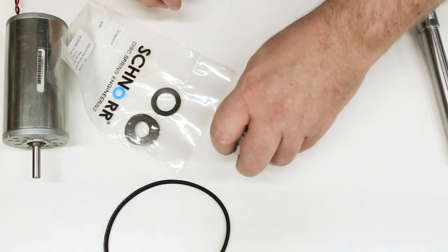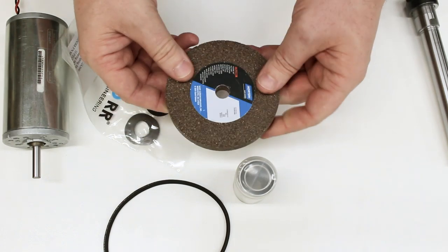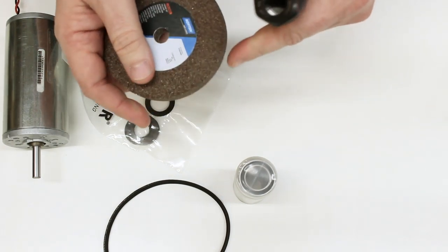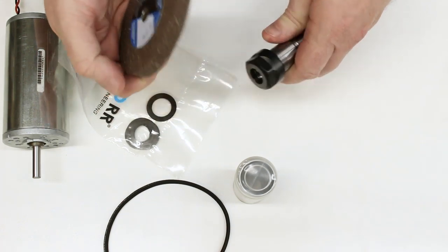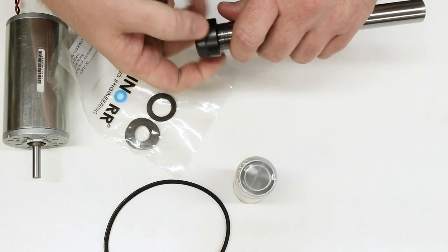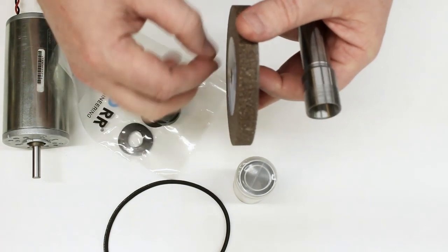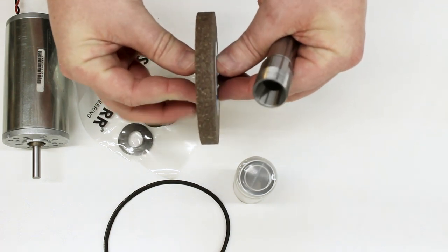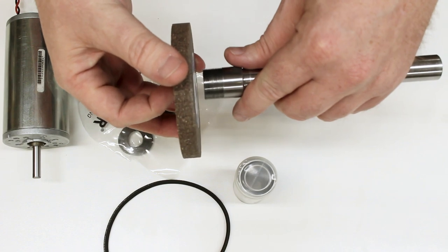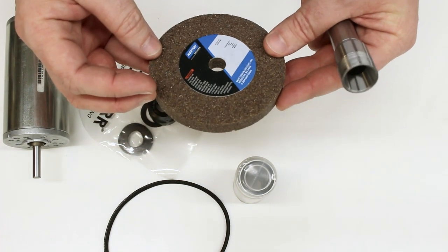The last thing I have here is a grinding wheel — a half-inch wide, four-inch grinding wheel. This is just what I could find available; I think a three-inch wheel might be a better fit. I'm ultimately going to make arbors for the wheels that clamp through the wheel, lock on, and have a taper that fits into the end of the spindle — one arbor per wheel, permanently attached.